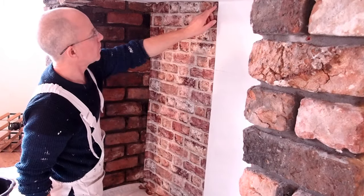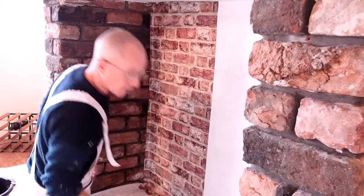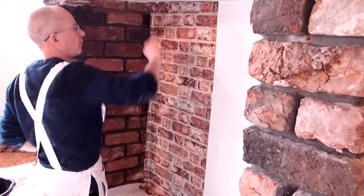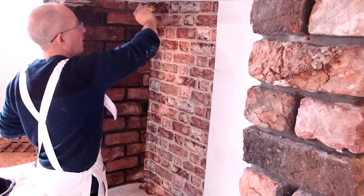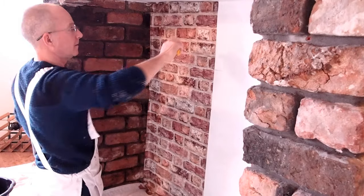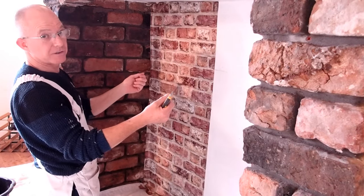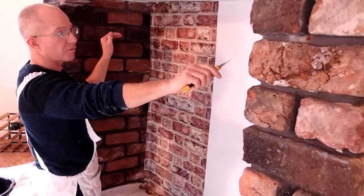Now, I'm going to cut across the ceiling first. There's a few ways you can use your snap blade, using your finger on the paper first, you can draw along, use your fingers on the ceiling and the wall as a guide. It takes a bit of practice, that one. You can also use a straight edge, but again, sometimes ceiling lines aren't straight.